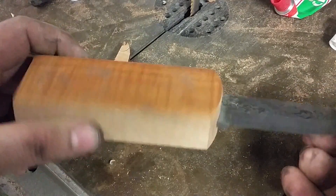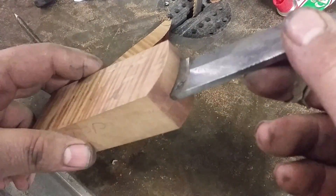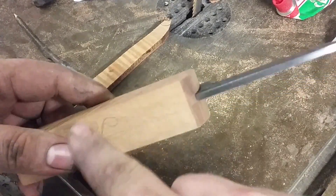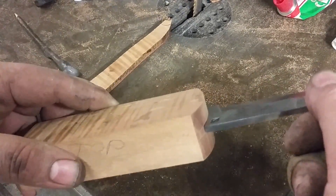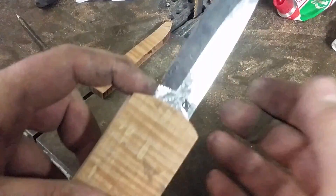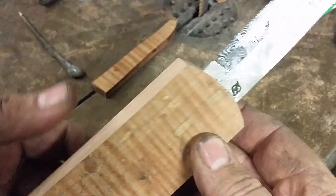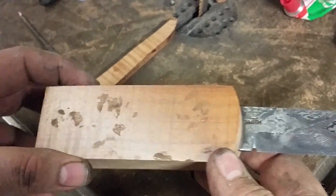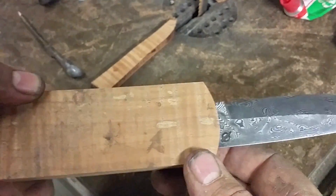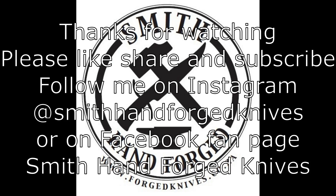Like every other knife handle now, you will just apply glue and glue it in. Take to heart that this is now a super tight fit, so when you push the tang in there's going to be an air pocket underneath that's going to want to push the knife out — so push it in slowly, let the glue come out, and make sure your shoulders are lined up with your filings. I'm not going to glue it now because I have other plans for this handle. I hope you enjoyed it — please like, share and subscribe. Thank you very much, goodbye.